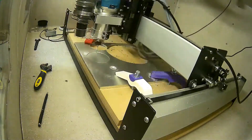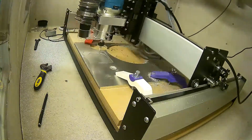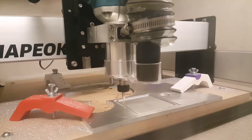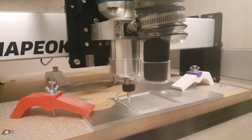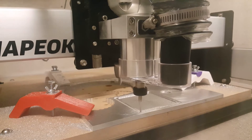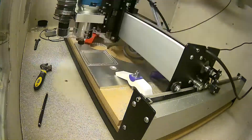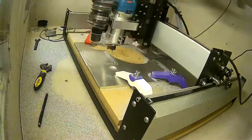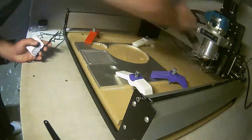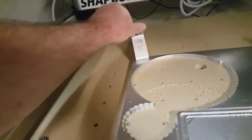The enclosure does a really good job of protecting against noise and debris — it's just a low hum on the outside. This is a sped-up version of the cutting; here is the actual speed the mill is working at, about 14 inches per minute. I'm using an eighth-inch Amana end mill, a high-speed steel end mill. It's a really inexpensive version — I broke an end mill on aluminum before just by running it too fast, so I switched to high-speed steel and I've been really happy with the results on aluminum since then.